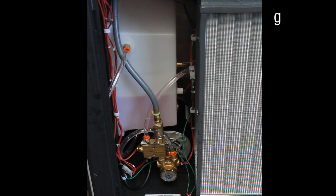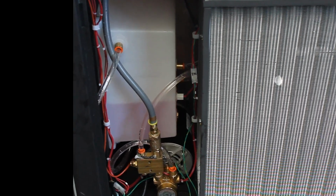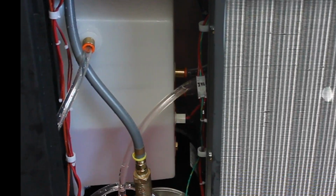Measuring coolant flow. Suggested every 4 months. Always use proper safety equipment to protect you and others around you. Start by making sure that the plasma is turned off. Remove the right side panels to reveal the pump. The pump is located in the lower left corner.